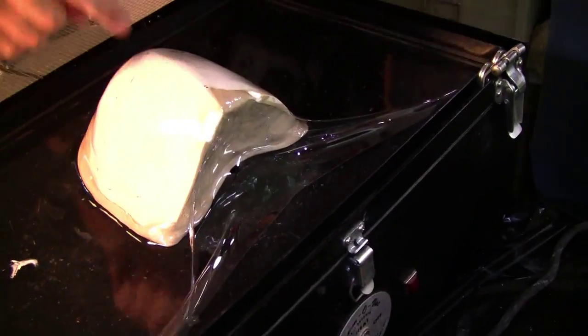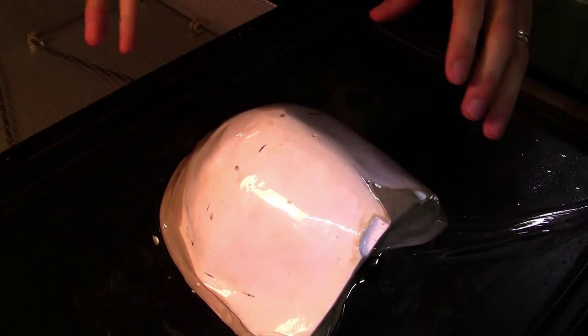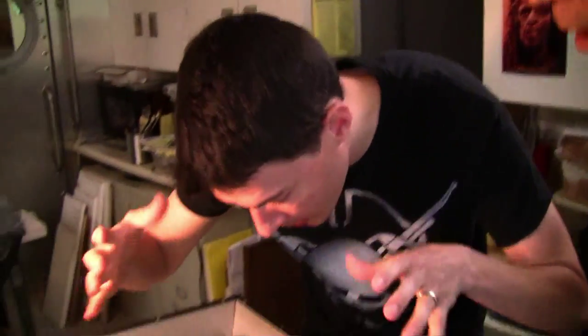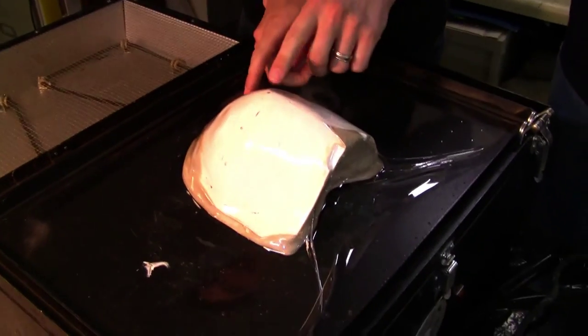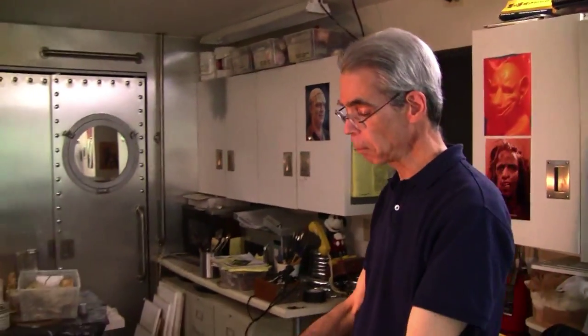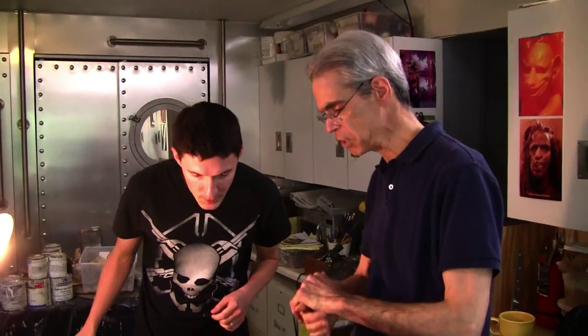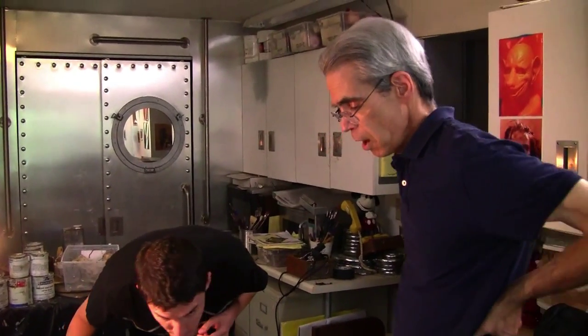I'm totally okay with it pulling there. What did we do right? After a couple of moments — after it started to really pull — you could actually see how the holes really got rid of all that extra garbage. There's no clay here. The holes probably made the difference, and the clay was doing no good. It was probably a friction thing that kept the material from stretching as it needs to do to be smooth. So cut out all the failures and just go directly to this.